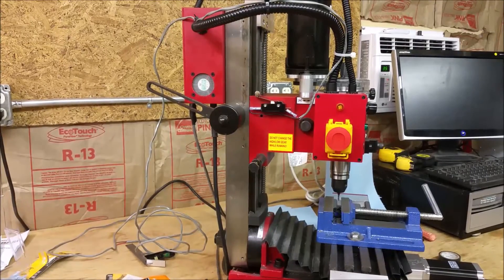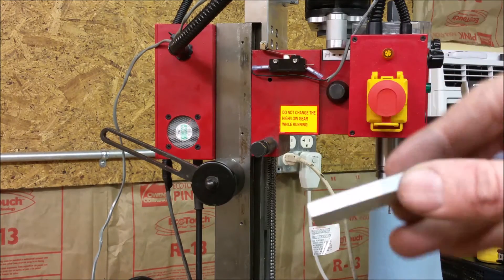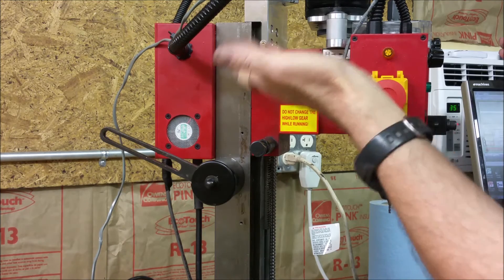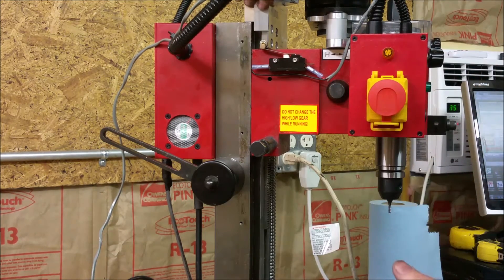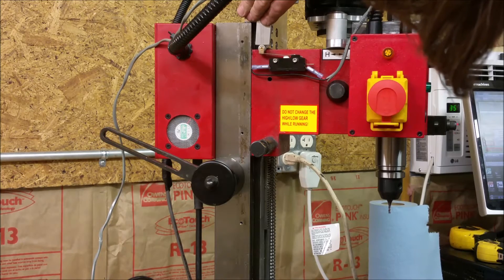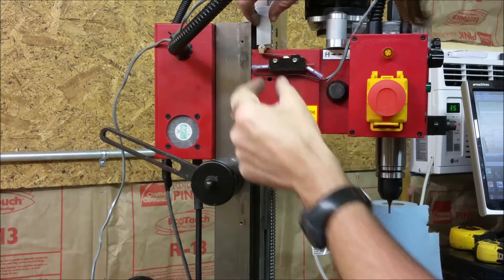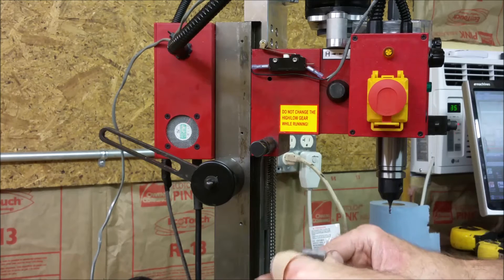I think my aluminum is finished cutting, so I'm going to go ahead and get that ready. I got my little piece of aluminum here that I made — I just cleaned it up on the belt sander. I'm going to put the head up as high as I'd safely want it, keeping it down like an eighth of an inch or so. I'm basically going to slide this down to see where it clicks. I want it to be right around there, but I'm going to make two slots in this thing for adjustment. I'll set this up to do some slotting on the mill — I've already got the vise in there and an eighth-inch end mill.